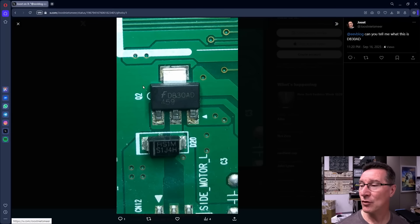The first thing you want to look at is the reference designator on the silkscreen — the white marking. It says Q2 here. Q indicates it's a transistor. It's not a diode — if it were a diode it would be D1. If it were a voltage regulator it might be Reg1 or V1 or something like that. Q2 just means it's the second transistor on the board. Q indicates that it's a transistor, so we know we're dealing with a transistor here.